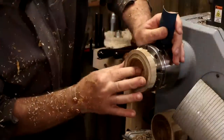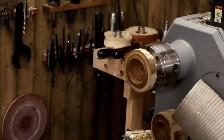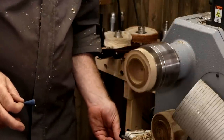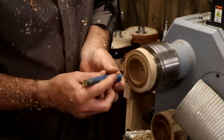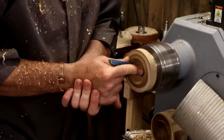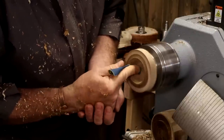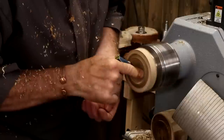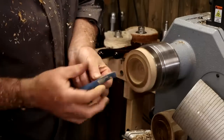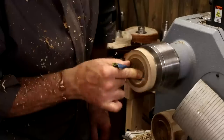Let's have a look, have a feel, see what we've got. Out on the edge — nothing there that won't clean up. Just got to turn the extractor on. We've taken the tool rest and the banjo right out. Fold the abrasive into three — this is 150 grit. We've taken the lathe down to about 700 for sanding speed.